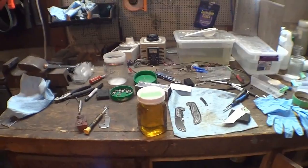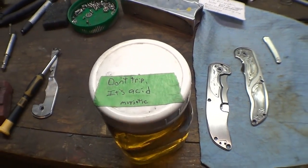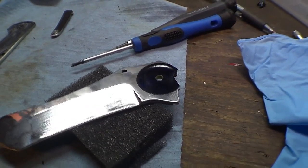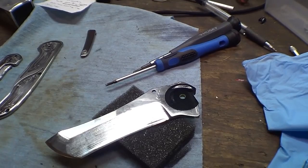In the last video we used sulfuric acid to etch with, but this time we are using muriatic acid, and it seems to work way better. It's a little bit more harsh, so it has a lot more potential to actually eat under the etching stickers and the nail polish. So even with these precautions, I still sometimes have to go in and buff the detent track just a little bit to make sure it's smooth and crisp. When etching with muriatic acid, I'm going to go do it outside, because if you do it inside in the closed shop, it'll probably rust any metal that's around. I'll put my mask on and gloves — that's proper safety etiquette.